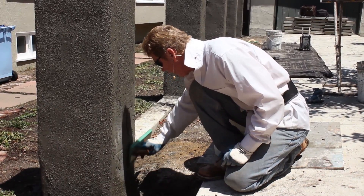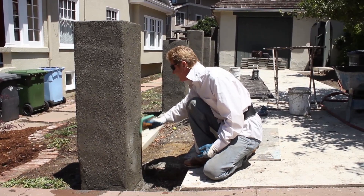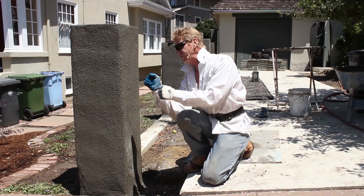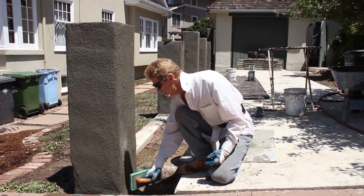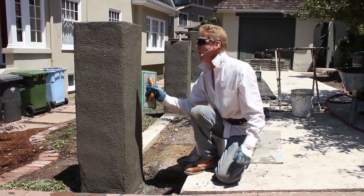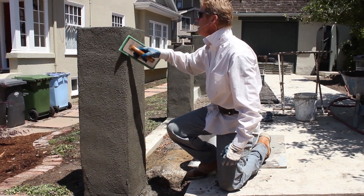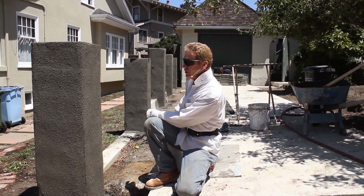If you ever want jagged corners, leave them alone. All you have to do is put mud on each side and you can get jagged corners easily. When he took a grinder and ground all this down, it not only created a lot of dust for him and his neighbors, but it made our job tougher. It's actually easier to get sporadic or wavy corners if you just leave them on. The homeowner said, 'Dang, if I'd known that I would have saved a lot of time.'